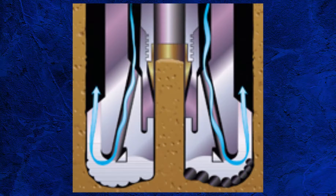Traditional wireline retrieval systems cut small gauge core, roughly 2¾ inch diameter in an 8½ inch hole, and is tripped through standard drill pipe. More modern wireline systems can cut much larger gauge core, up to 3½ inches in an 8½ inch hole, but requires special drill pipe to be provided.